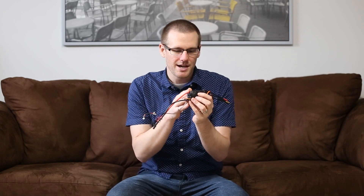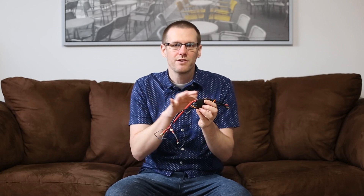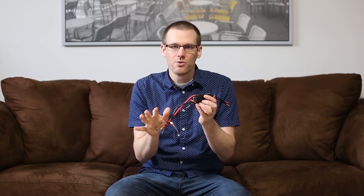Our ESC has power coming from our battery. That power goes to the speed control, and the speed control is turning the power on and off several thousand times a second to get that power to the motor. What you do notice on the input side of your speed control are these capacitors. These capacitors are responsible for soaking up all the different voltage spikes that you may see — trying to smooth everything out and dampen the load.